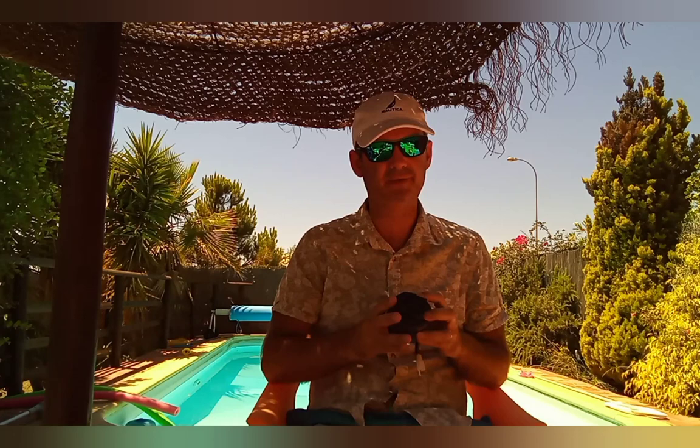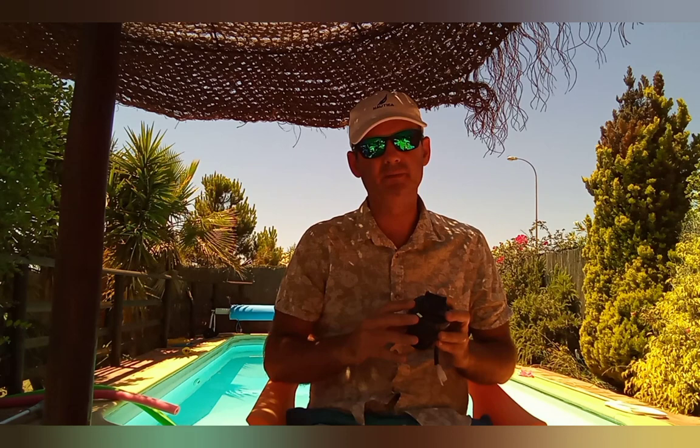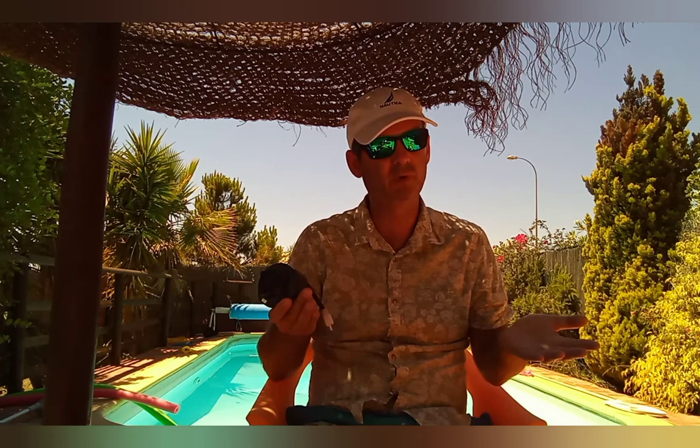If you want to go to another path, go straight to the cooled camera, because they have a different system. They allow the camera to stay below 0 degrees and in a linear and stable fluctuation, they don't have condensation, or at least they manage well how to get rid of that, and the camera works fine. So if you are in doubt and you want to buy an uncooled camera like this, it will work okay. If it works for me in these high temperatures we have here, if you have less, it will work for sure. So go straight away for that.